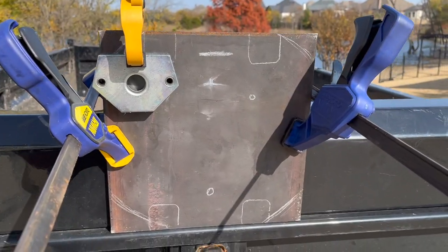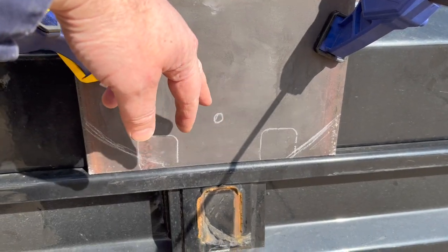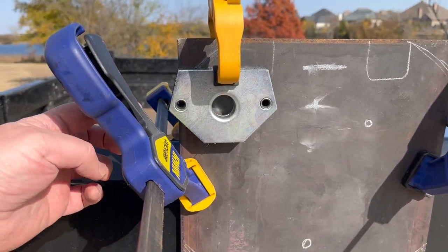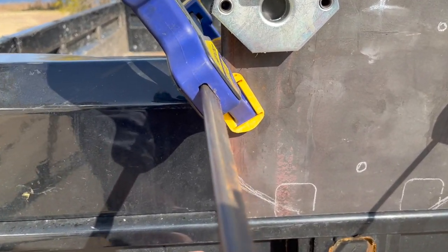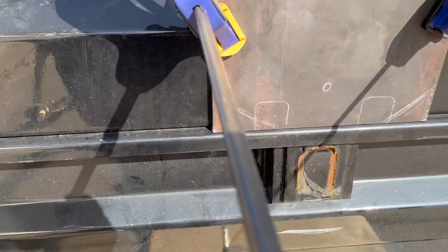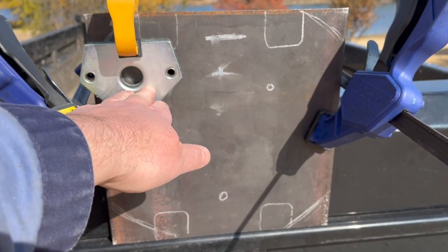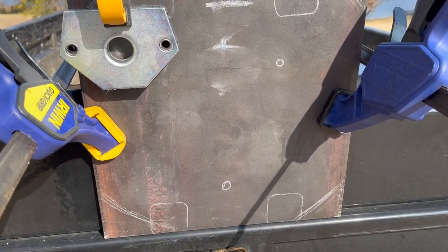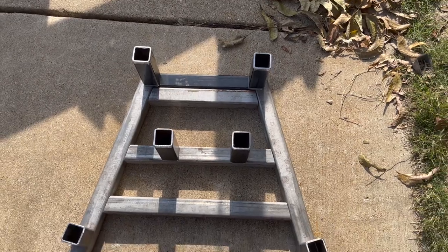It's sort of mocked up — this is the actual height it needs to be at. I'm going to come down at a 15-degree angle off the sides for my supports. Right now I'm just cutting the pieces — I'll put one here, one here, and one down below. I've got about a 25-inch piece coming down each side; at this mark it's going to be 12 inches across. Then we'll put another cross support down here for the bottom legs, and I think it's going to work.